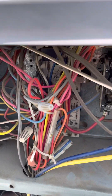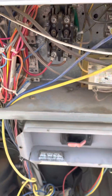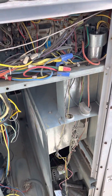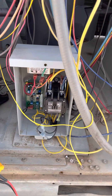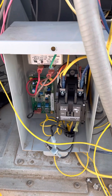If you're in residential you may not be familiar with these, but in commercial they're pretty common, especially for Carrier units. I've never really seen them in any other unit other than Carrier. This unit also has a low ambient control — typically this is called a Motor Master.